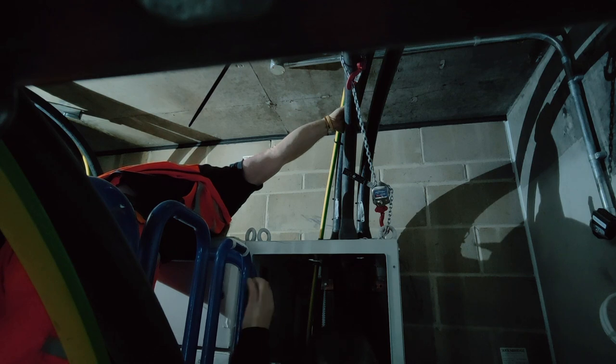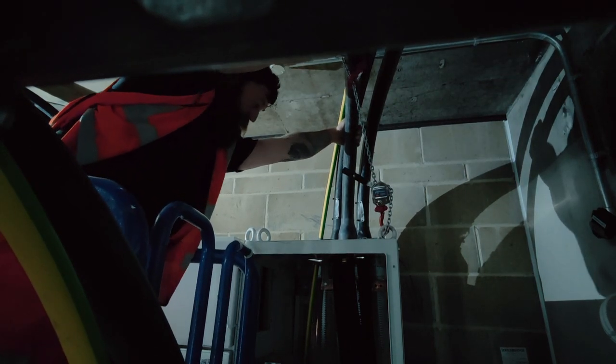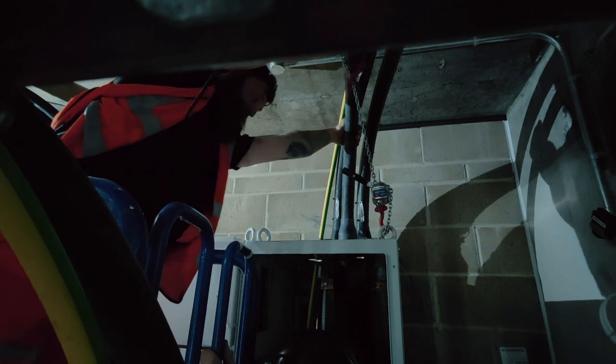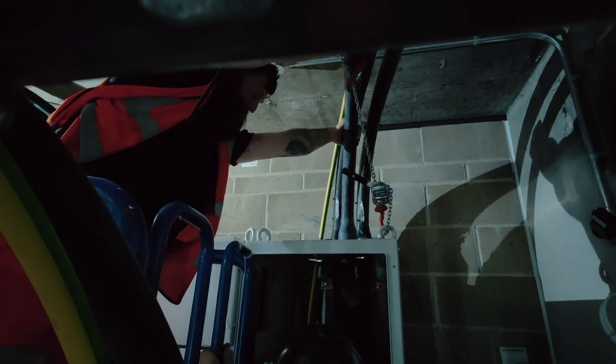Oh, it's good hand tight, but it goes stiff. I was going to say, check if there's a bit of halfway up. It's when it damages threads when it drops through, yeah. The thing is, it might not be damaging them, it might just be gathering a bit of aluminium. We'll wiggle it a little bit. See if you can get it a bit more. Obviously, I can get it with the grips. Come on. That's it, that's all I'm getting.